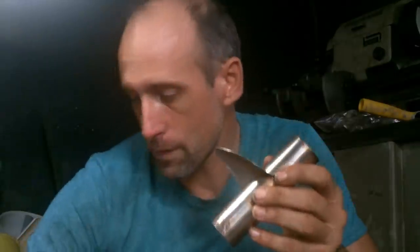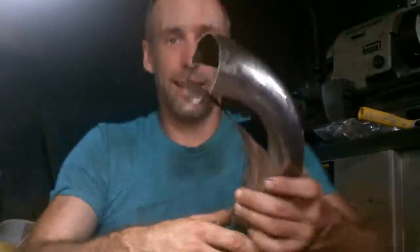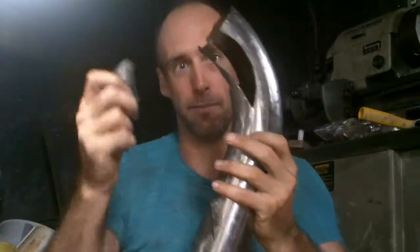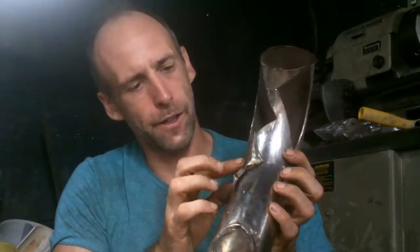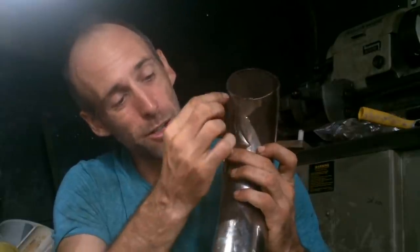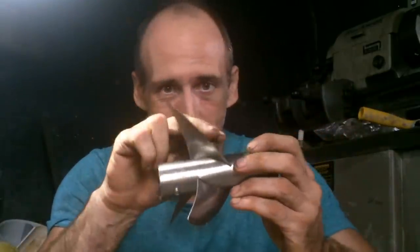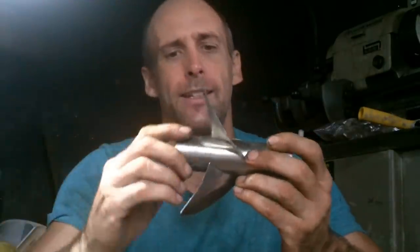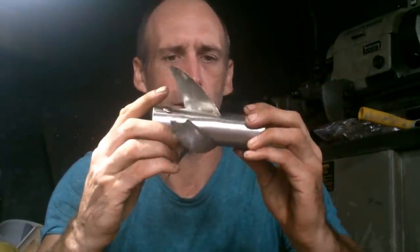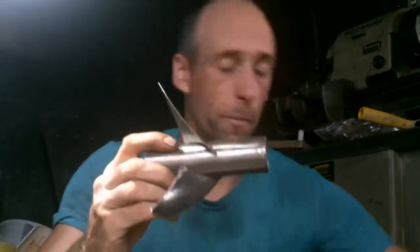I took the blades off and pulled out a piece of curvy pipe I'd been saving. Propeller blades benefit from curving one way and then the opposite way — like a saddle curve — and the inside curve of a pipe does exactly that. I laid this on here, figured out where it matched closest, drew my blade a little longer at the same width, cut it out, and got three blades I didn't have to curve. Because I didn't curve them, the curve is really even with no dents.